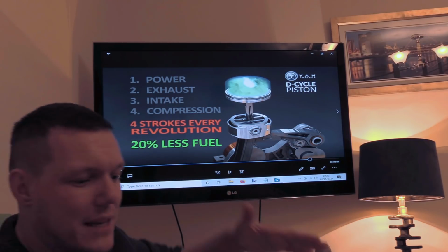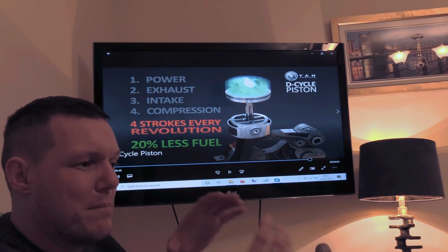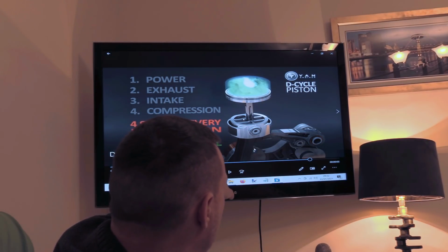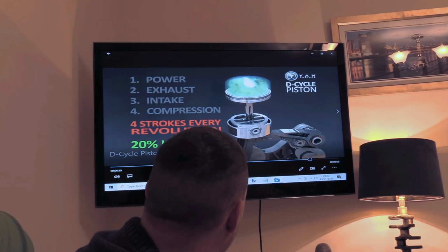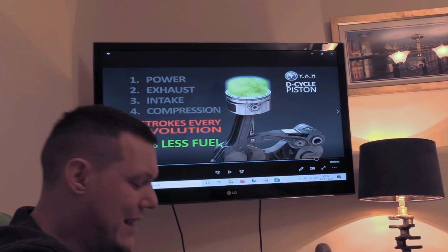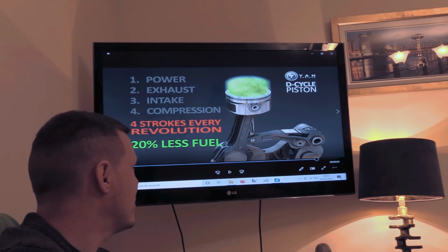Because when these two clap together, if we look at how they clap together, the main bulk piston is now getting a move on, right? She's 45 degrees after bottom dead centre. It's going to start to accelerate. And when it does, that clap of one coming down, the other one coming up, when you start going 5,000 RPM and stuff, it's a lot of force.